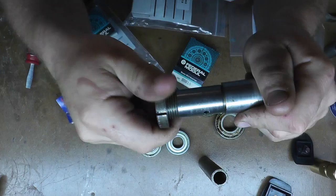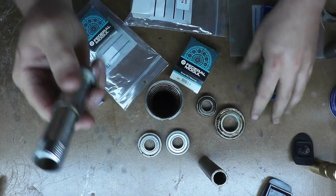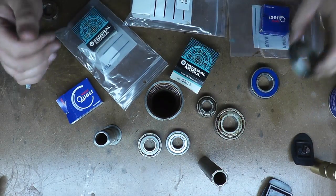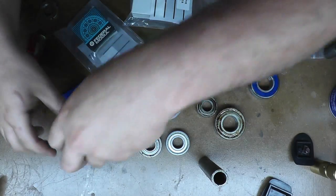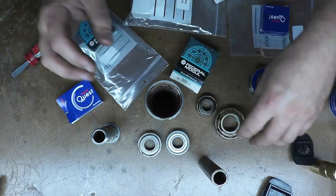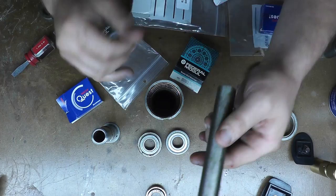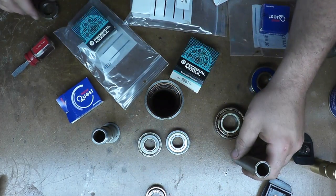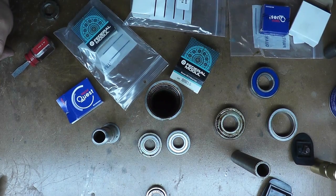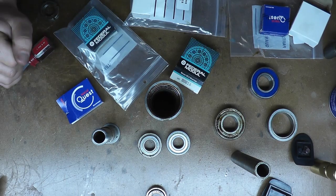This is all left-hand thread, so that's that. These two larger bearings go on this shaft with a spacer in between, and there's also a backing spacer in between them, plus another little ring that goes inside here. These two smaller bearings go into this spindle with a tube in between, and then these two small ones go in the high speed pulley. So let me get all these bearings in place and we'll start putting the machine back together.